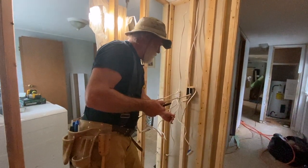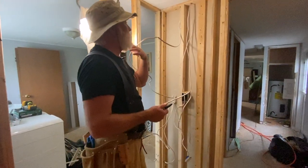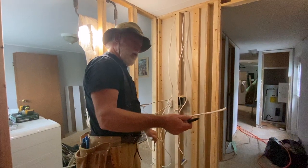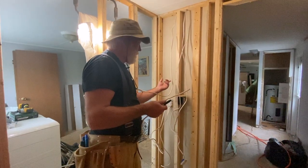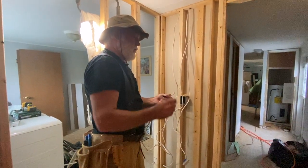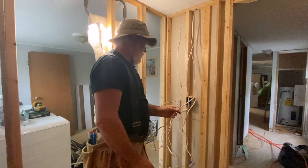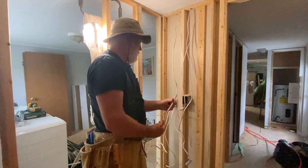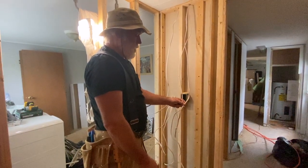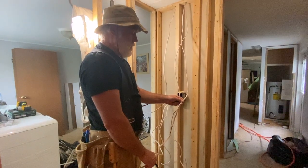I know that this wire that comes through the wall is bringing the power in from the breaker box and it goes into this switch. That means I have one wire going out to the light fixture in the bedroom. So this switch is controlling power on this wire, and then this extra wire is actually bringing power over to the other switch and onto the rest of the circuit. So I know that this is going to be my power coming in — I'm just going to write a 'P' on it for power for right now. I should put that a little further down because I'm going to be cutting off the insulation there. What we don't know is which of these two wires controls the light fixture here in the laundry room. So I'm going to wire the power up directly to the light switch by putting a wire nut between these wires, and we'll turn the breaker back on and see if the light comes on.